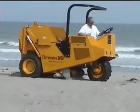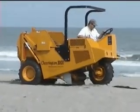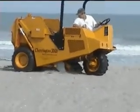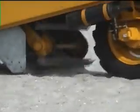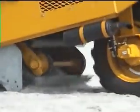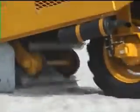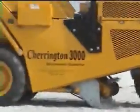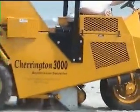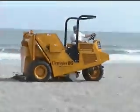It's best to begin by digging as shallow as possible while yet effectively picking up surface trash. You will find that an optimum digging depth for superior beach maintenance is about 2 inches deep. And this can be accomplished by setting the depth just deep enough to remove the front wheel track. In most cases, removing the 3/4 inch spacer should be about right.